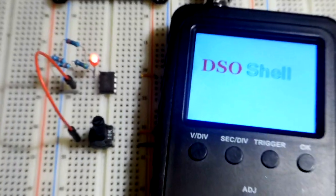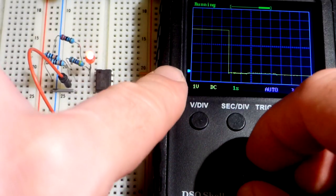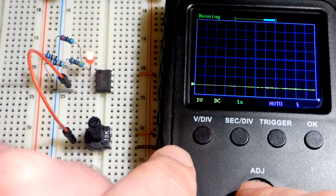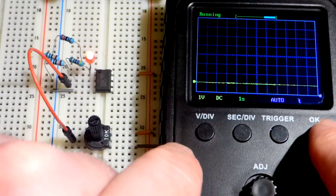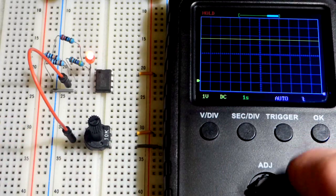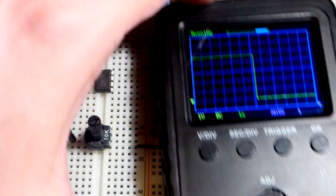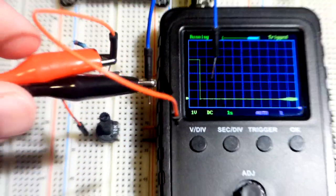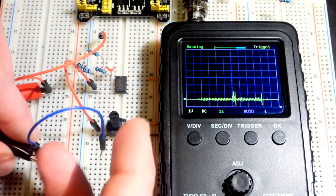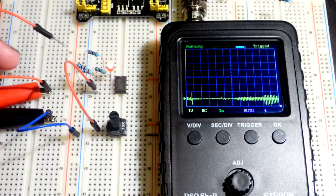It's always more fun to look at voltages with an oscilloscope than just watching the LED, so we'll turn that on. I'll adjust to two volts per division, then one volt per division. At the other end of the cable we have it set to measure DC. I'll use the alligator clips and tack them into a slot—this one goes to the negative rail so we measure voltage relative to the power supply.